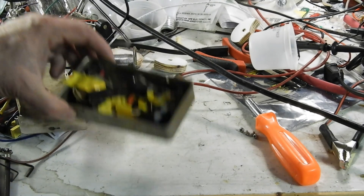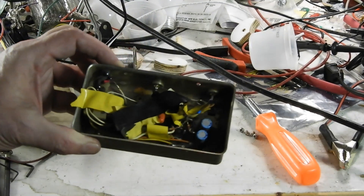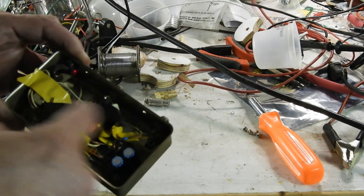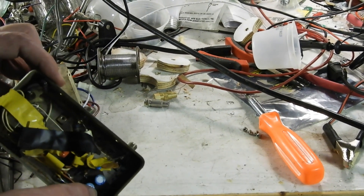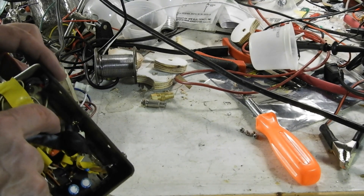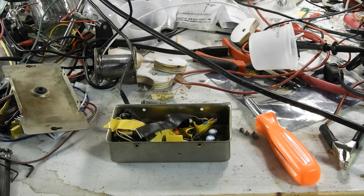It's as ugly as I thought it would be. I don't know if I really want to pry through all this junk. It's my electrical tape. Basically, I just wanted to use the power supply out of this module and cut away the PC board except for the power supply. Looks like I stuck it on with one screw. And then I just have my capacitors all paralleled up to make the right values. I don't know why this one is so cockeyed — probably a bad cap on this white noise output, I'm guessing. Maybe I'll get to that later if I get patient.